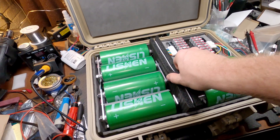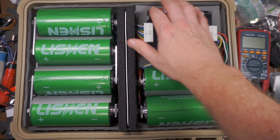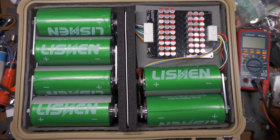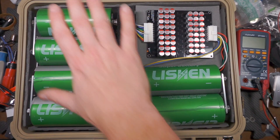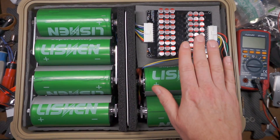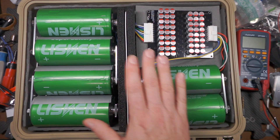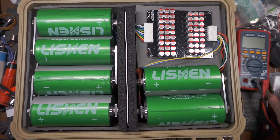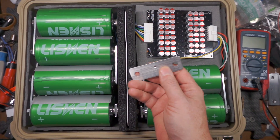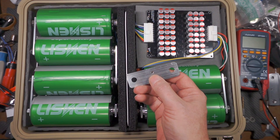The neoprene foam is a yoga mat, and it's just all kinds of different foam — I think these are like floor pad pieces of foam. This took a long time. I took about two weeks to charge and test each cell to pick the strongest ones — you've got to thin the herd somehow. It took me even like three days just to make all the bus bars. I've made something like 30 of these things. They're precisely made — the hole spacing is very precise.